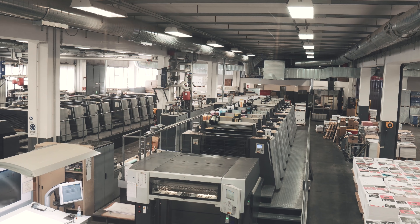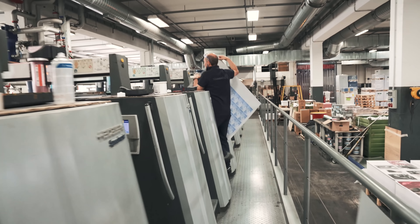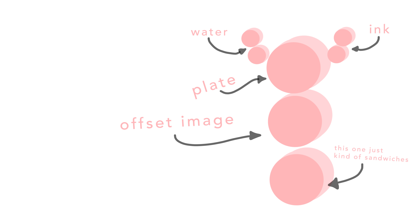The plates are then loaded into the Heidelberg printing press — an insanely large, expensive machine. All four plates comprising the different colours are loaded at once and the paper goes through and receives all of the different colours. The way this works is through a system of rollers. The plate is loaded onto the top roller, which is then coated with water and ink, allowing the printable area of the plate to be inked and offset — or transferred — onto the second roller, which then rolls or prints onto the paper as it passes through the press. This is where it gets the name of the offset process.